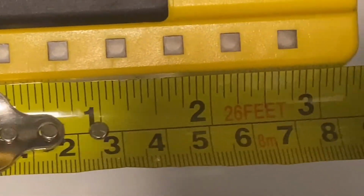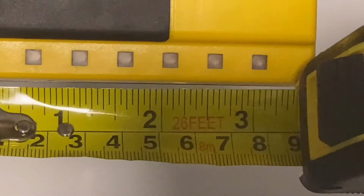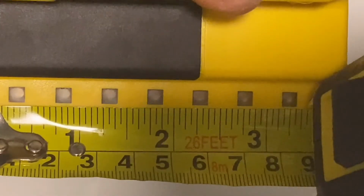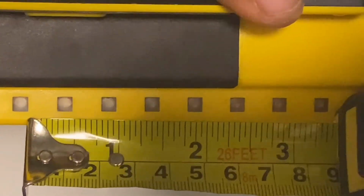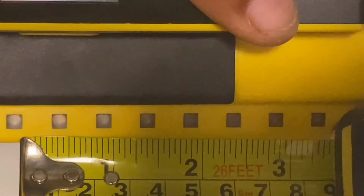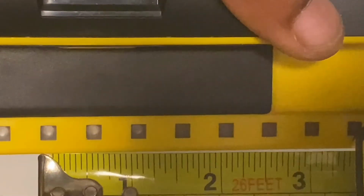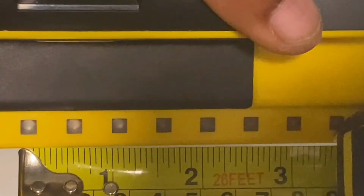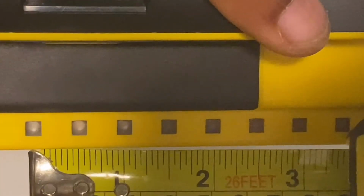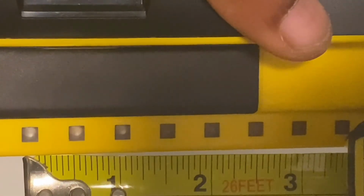Or you might have foil backed insulation, although foil backed insulation is not very common. Metal foil can cause inconsistent readings with all electronic stud finders, including this Franklin sensor. Just be wary if you're getting a lot of LEDs illuminating. It could be anything, from foil to combined studs. Just a personal opinion, I'd rather stick with the 1.5 inch stud if all I'm using is a stud finder.